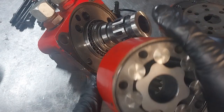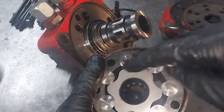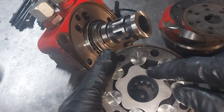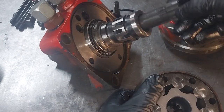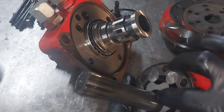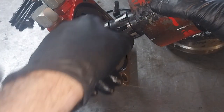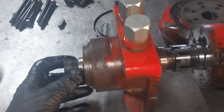This unit here then distributes oil out through these holes, through this plate here — the distributor plate — into this rotor assembly. As oil under pressure comes into certain areas in here, it forces this unit to rotate. As this rotates, this shaft — most people in the industry call it a dog bone because it kind of looks like one — as this part rotates it transfers rotation down through there, which then rotates this output shaft.